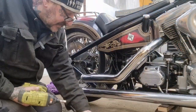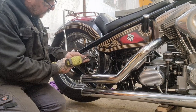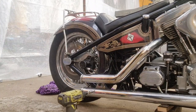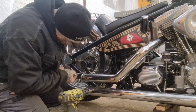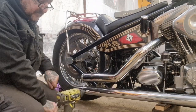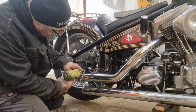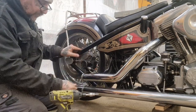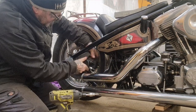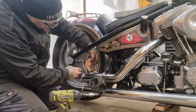Right, let's get the caliper off. Couple of torx fittings - they're tight. Why they're that tight I don't know. The bike slid there on the wood, the handlebars moved. Take the caliper off - these two draw bolts, yeah it slides on them, so it's just a nice slide fit. And then this should wiggle out of the way exposing the pads, keeper spring - which is a pain in the arse by the way - and pretty new pads.